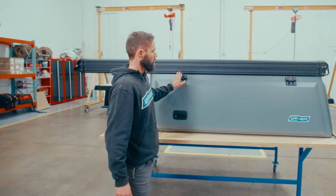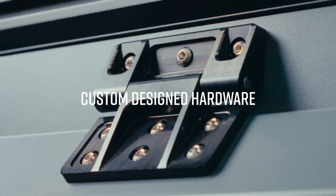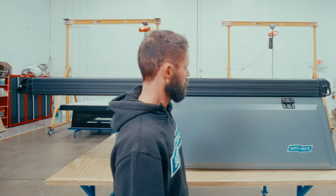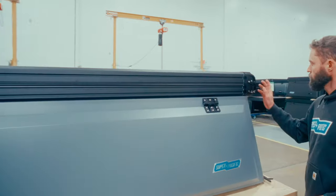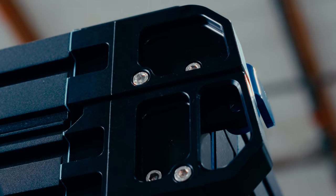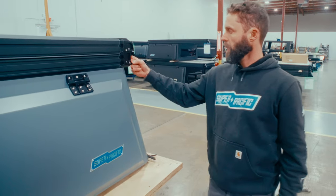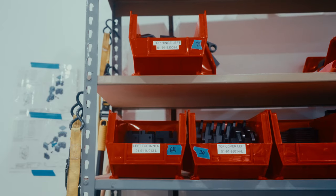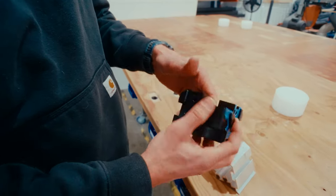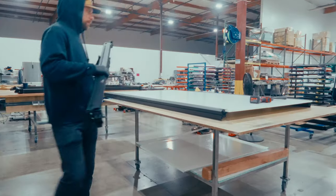And then all of our hardware we designed, it's all machined from billet aluminum. And then we work with a local anodizer to use a UV stable anodizing. We designed the bottom assembly for the latch and the top assembly to work together, create a pass through so you can lock it. This is a little lash point, a little handle to grab when you're getting up on the tailgate. As we were designing them, we really tried to leverage every opportunity to add a little utility. So there's drains internal to these parts that let any water that might work its way into the clamshell get out.